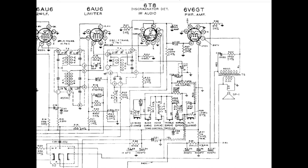But once it's done all that over there, the audio signal goes through the band switch selector and comes back on this line right here. Follow this around if you can. Goes through this switch. This is the phono radio switch. Then around here, sorry, went off screen. Back up here, over here to this gob of stuff that all has to do with tone controls. Goes into a shielded cable, runs along the side of the chassis, goes up through here. You'll notice the schematic says the alto button is closed. That means to make this go this way, you have to have the alto button depressed, which I do in this case.